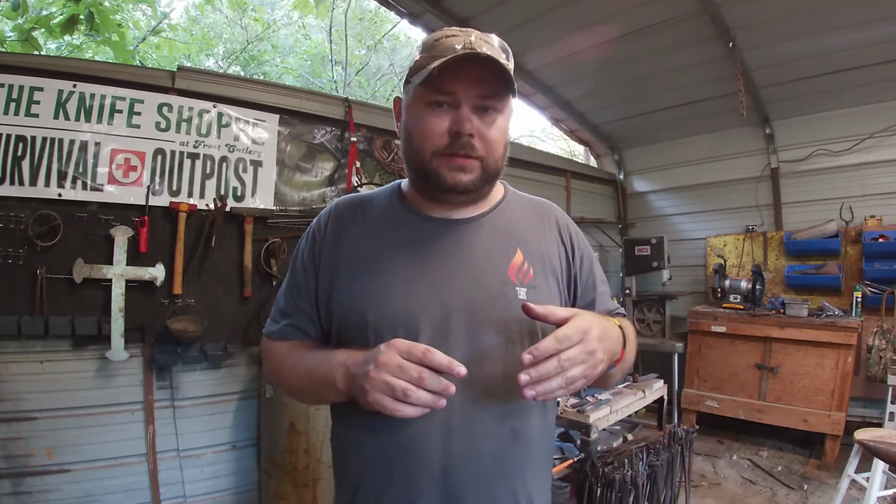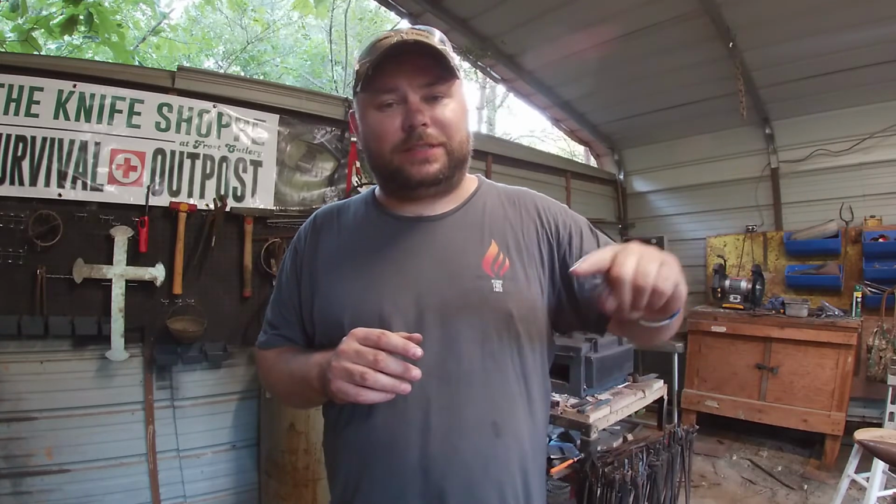My recommendation is if you have any mild steel flat bar laying around, cut yourself a piece, sand it to where you can see the metal really well, and do a couple of tests on your material. And also pick up an oven thermometer at Walmart, I think they have them in their cooking section, that you can set inside your oven and actually see what the temperature gauge is, because a lot of times the dial is wrong. It gets close, but it's not exact. So where mine is 435, if you live up north, yours might actually have to be at 450. It all depends on your oven and where you live. I mean, there's a big formula for this.